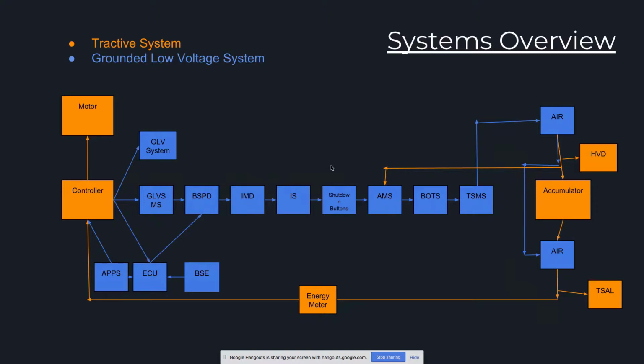The regulations stated that, so I was just going to use a high impedance path out, but then again, I was having to think about how you'd actually accomplish galvanic isolation, because you can't use the same ground between the two systems. So actually, the tractive system active light is going to have to be entirely on the high voltage side. I was just going to use a really, really high impedance path that allows enough current to power whatever LED or indicator light we're using. The current is ultimately sourced, just not a whole lot of it, off of that high voltage line. You just have to make sure there's enough insulation, that it's not getting anywhere near anything that's going to come into contact with the driver, where you're getting the light output from it.